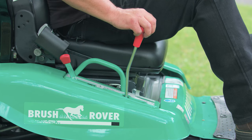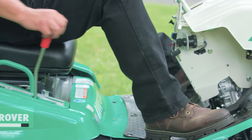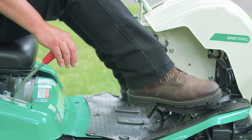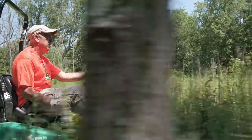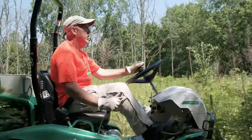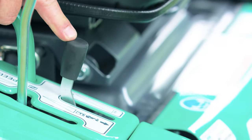This big, tall red lever is the hydrostatic drive transmission lever. It is basically a gas pedal you operate with your hand. This lever is convenient when you encounter very stubborn brush. It is directly connected to a traditional foot pedal that will do the same function, so the operator has the option of either one. Next to the hydrostatic drive control lever is the black engine speed control lever.